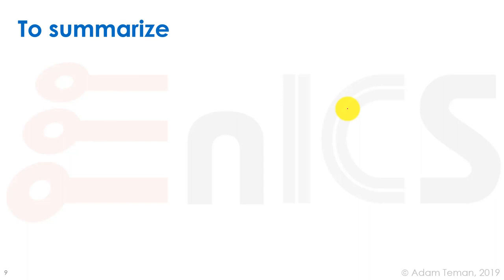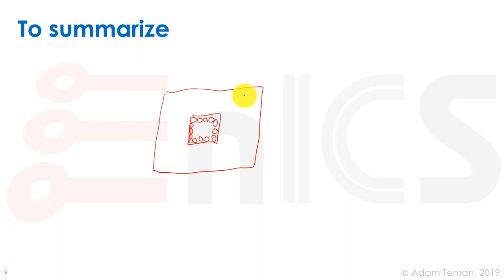To summarize: we have our IC — a small chip. Around it we put bond pads, which are top metal layers left open (not covered by passivation). We place the chip on a package substrate, usually gluing it. The substrate has landing areas inside connected to pins that go to the board. We then connect chip to package by soldering gold wires — the wire bonding process.